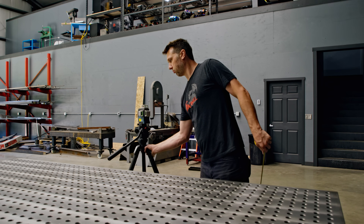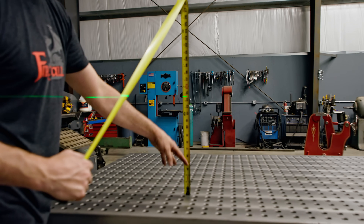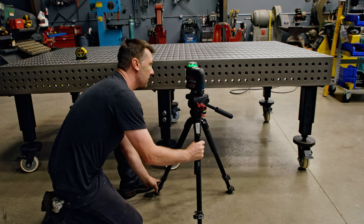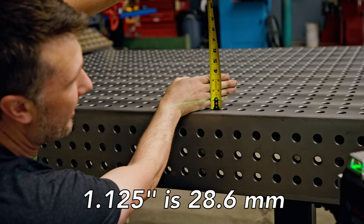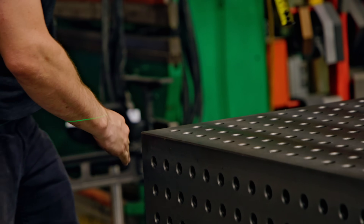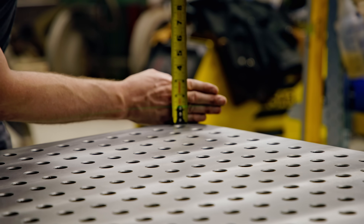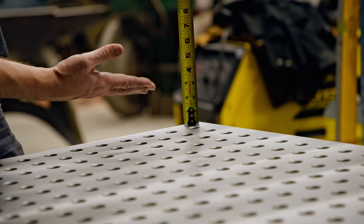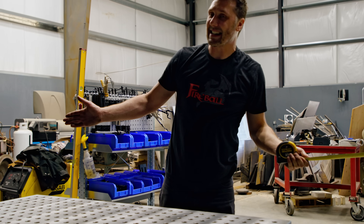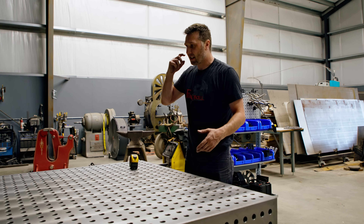I'm probably too high off the table right now — about 14 and a half inches. I don't want that because I might be skewing the results. I want to get this laser line down close to the one to two inch elevation to remove some errors. After dropping the tripod I'm sitting at one inch and an eighth at the top of the line — that's pretty close. As long as I pick a standard I can go from corner to corner. In this corner I'm just a skosh under the line, so I'm really close. Over here I'm above — this leg needs to go higher. If your line is higher than the tape you need to raise the foot, and if lower, drop it. I'm off about a sixteenth of an inch according to the laser. Which do you trust — the construction level or the laser? That's two ways to go about the same task.